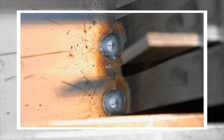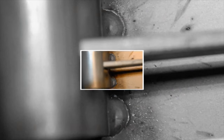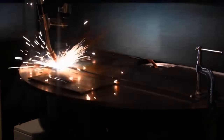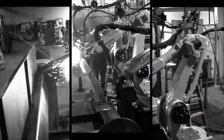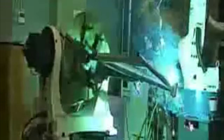The secondary process that we researched was MIG welding, which involves continuously feeding the wire toward a heated tip. This results in the joining of components held together by the deposits from the wire. Along with the wire, a shielding gas is passed through a welding gun to protect the newly formed joint from contamination. This process can be done manually or with the help of a machine, as in robotic MIG welding. In the case of the bicycle frame, the tube hydroformed pieces are welded together to complete the product.